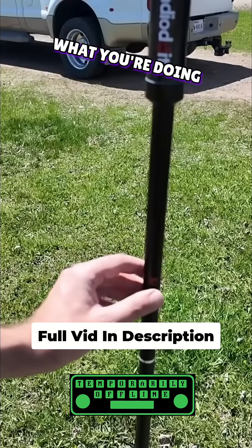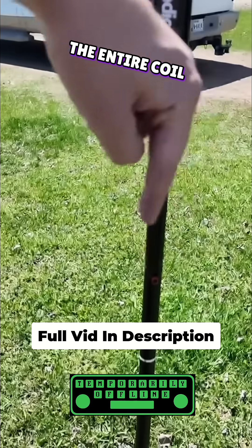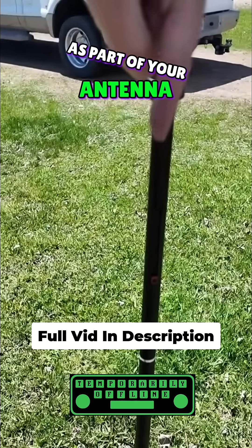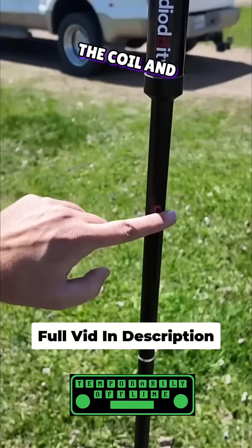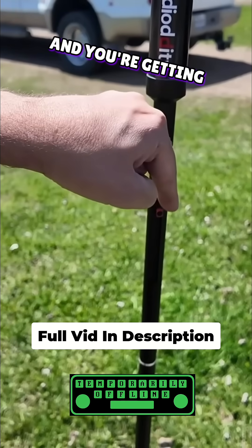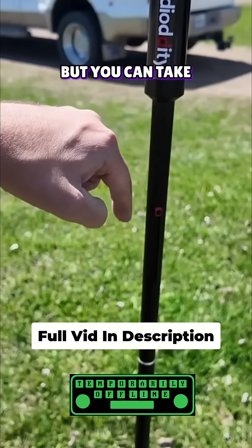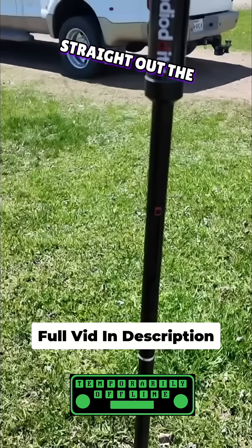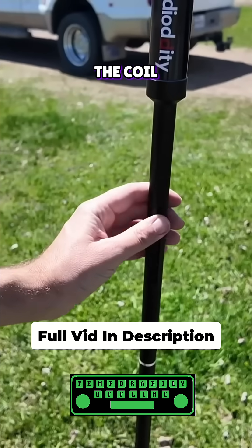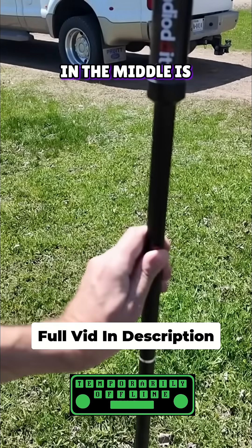At the bottom, you're tapping the very bottom wire of the coil, and you use the entire coil going all the way up as part of your antenna. When you move the slider to the top, you're bypassing all of the coil and tapping into just the top — maybe a quarter or half a turn. I'd have to take it apart to tell you for sure, but it may be a quarter of a turn, and then straight out the antenna. So very little of the coil versus all of the coil, and in the middle you get half the coil.